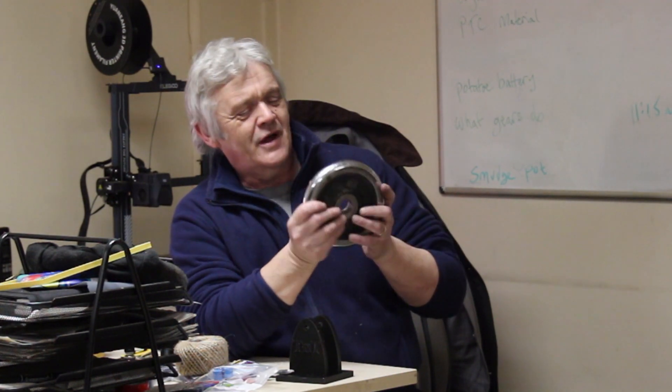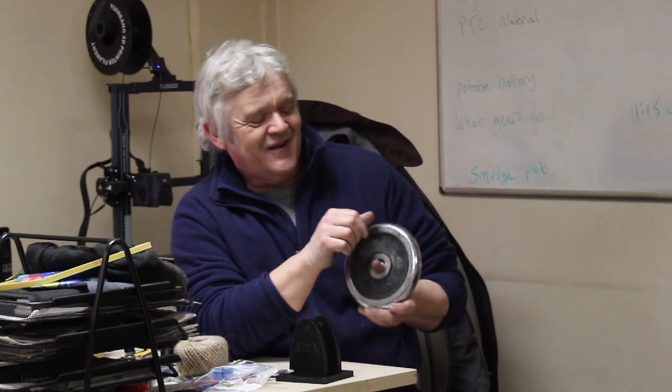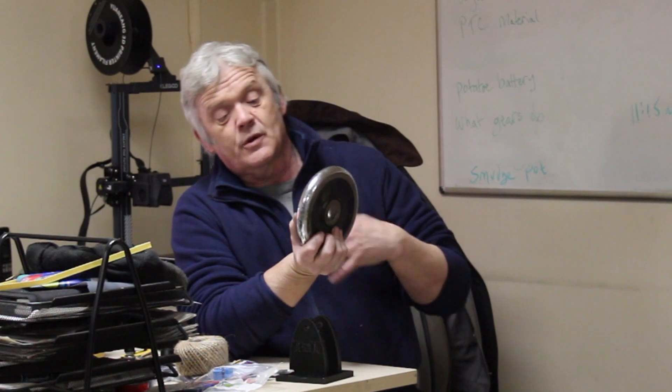It's a big old weight, and if you were to try to turn this at something like 30,000 RPM you'd probably be sorry. But in a home installation you're extremely unlikely to get up to that kind of RPM, so the revolutions per minute we're going to spin it at will probably function quite well as a flywheel. Now obviously it's got this great big hole in it where the weight-lifting bar went, and we really want to be able to put some magnets and bearings in there. We could try to source bearings at 26.3mm, but we do have a 3D printer.